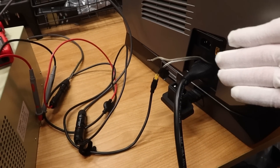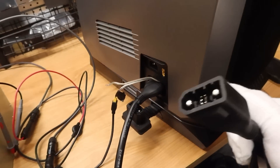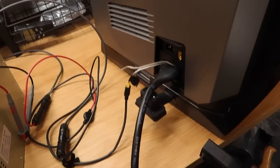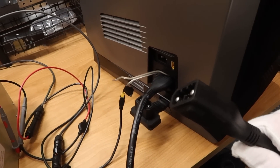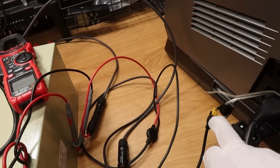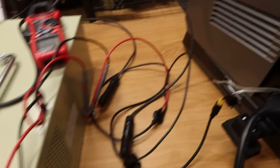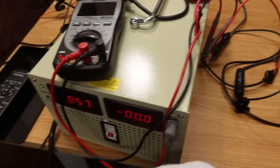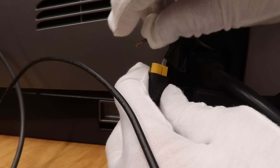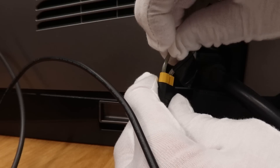Dozens of you have asked: can you just hack the cable? Say you got this cable from EcoFlow and you're just going to chop it up and hook your own 48-volt battery to it — because this actually runs on a 48-volt battery. I jacked two wires in on the positive and negative of the main leads and I'm just shoving wires into the XT60. I did verify this connection works. When I originally hooked this battery up to the air conditioner and did the same thing, it said 57 volts. So I set this to 57 volts.